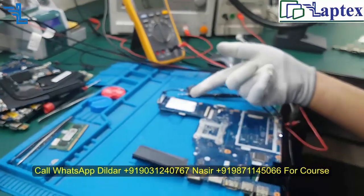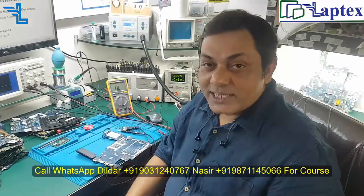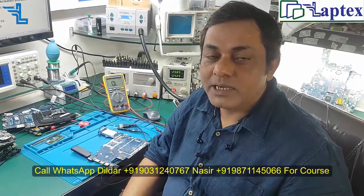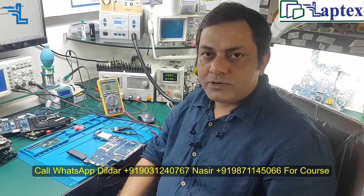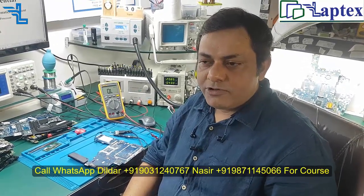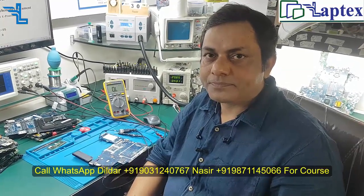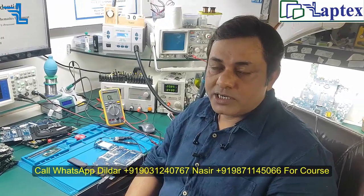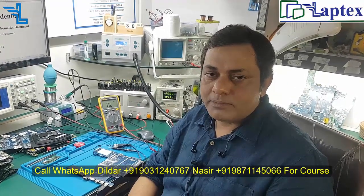I received this board as no power on — it was not turning on. As you have seen in the video, a very silly thing can cause a big problem. So this is my recommendation to all of you working in this field: if you are starting to repair a motherboard, just take out the coin cell first. Especially, you must do this when you are going to check the RTC section. These are very important steps you always have to remember.